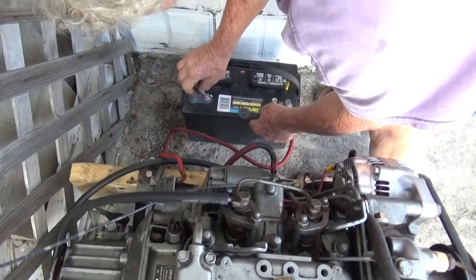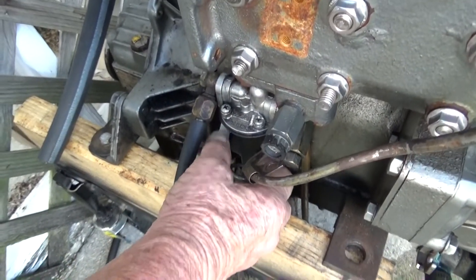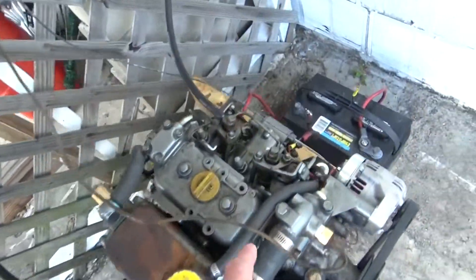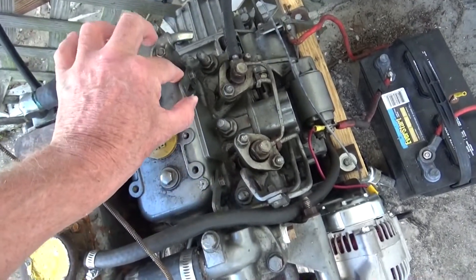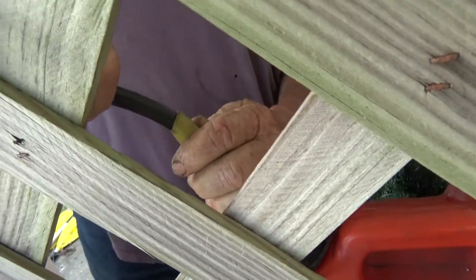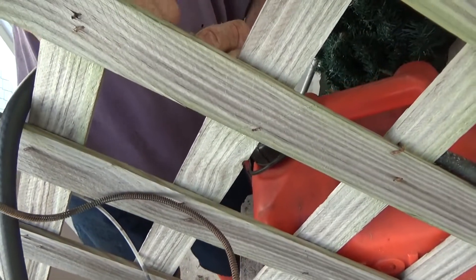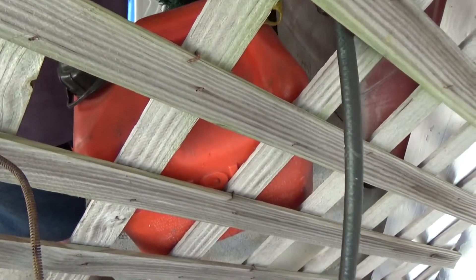It's got a lever that you can use to prime it — that's the lift pump. These are the fuel injectors, one and two. These are the compression releases. We're shoving one hose in one side all the way to the bottom of the neck, because air is a diesel engine's worst enemy. This is the return line, so I put it in the vent.